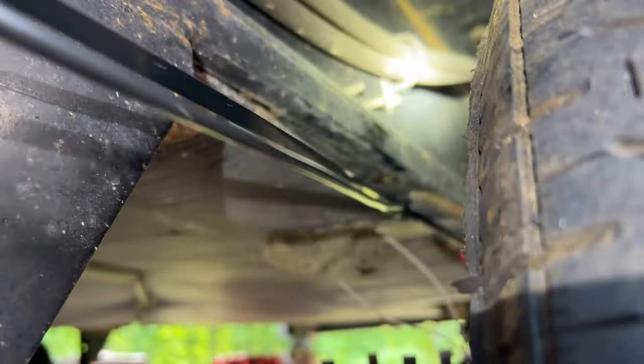There we go. So we got a red. Do we want solid red? Yeah, because red means it's vented lead acid. So it means that we've set the battery type to that. And I think this is turning yellow because it's going down because we're not charging it. I turned the solar panels off. Right. So I'm gonna turn them back on now.